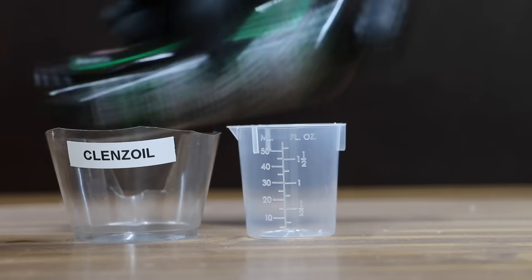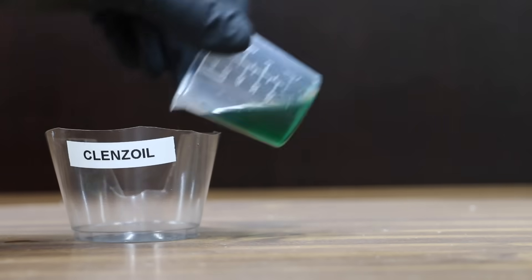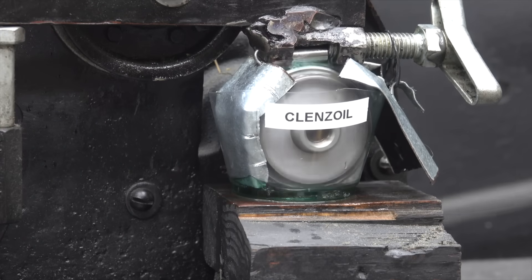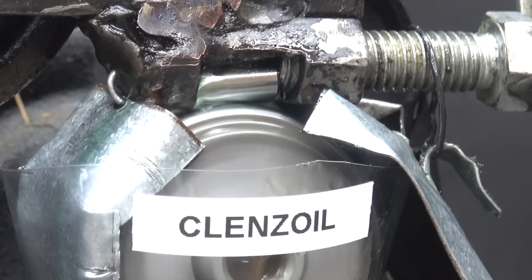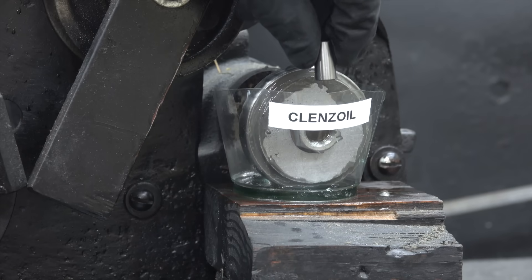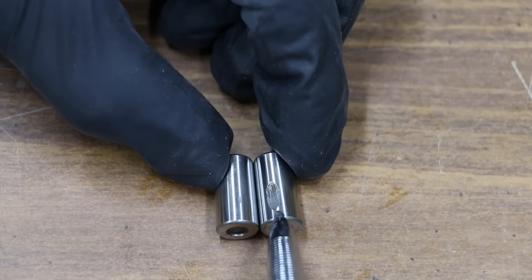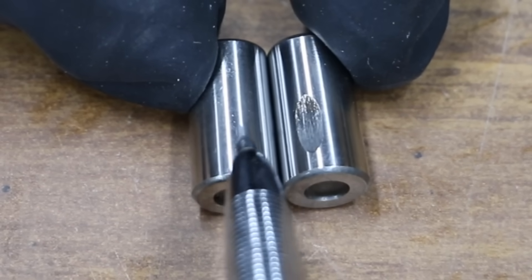I really like the viscosity of the Cleanse Oil — it seems to have the right viscosity for easy application. A very low viscosity product runs and drips, while too thick is difficult to apply. The Cleanse Oil is off to a much better start than the Ballistol with a lot less noise and less friction. The tester never even reached 400 watts — nearly 100 watts less than the Ballistol. The test pin felt cooler to the touch, and the Cleanse Oil wear scar is extremely small. The Cleanse Oil easily came out on top with a wear scar of only 1.81 millimeters, compared to 7.26 for the Ballistol.